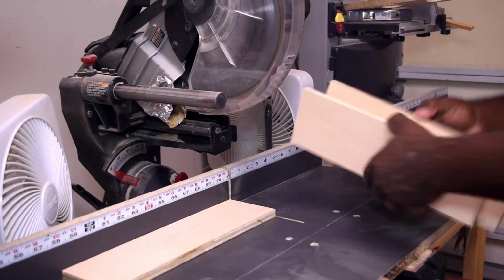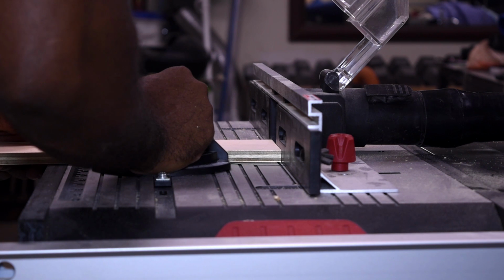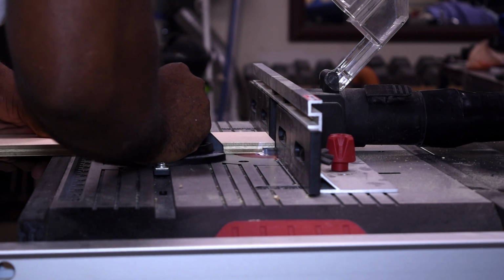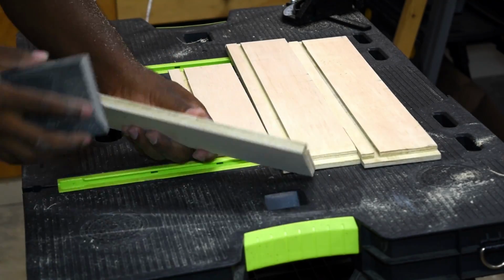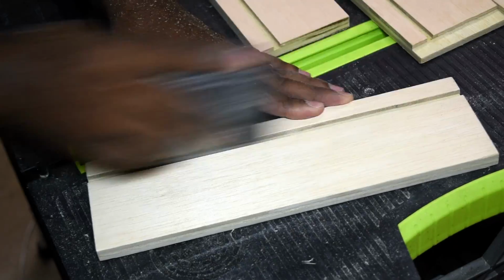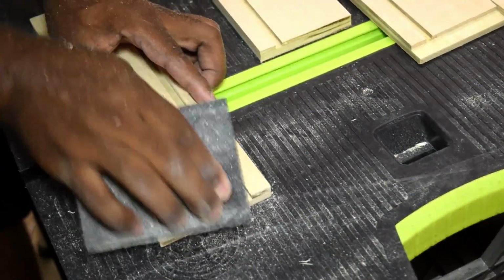To construct the drawers, I'm using a rabbet joint, and I'm using my router to do it, but you can also use a handsaw. But only cut the rabbet in the face and the back of the drawer, not the sides. Now cut out the bottom for the drawer. Learning from my past experience, I think it's better to sand the pieces down now before it's assembled, because not only will it make your life a lot easier, but you also get a better quality of sanding.